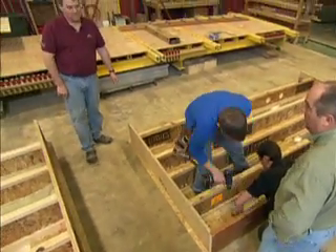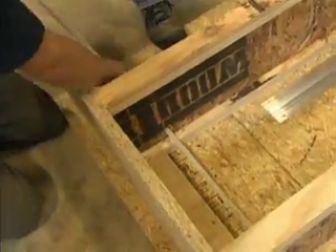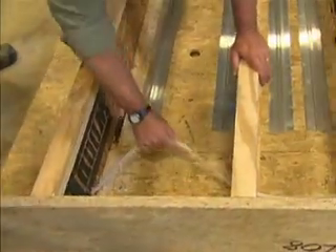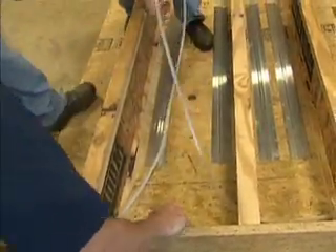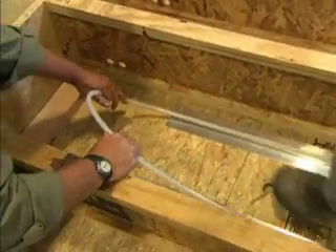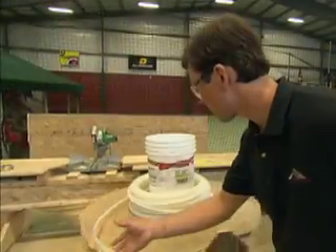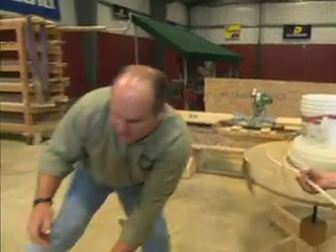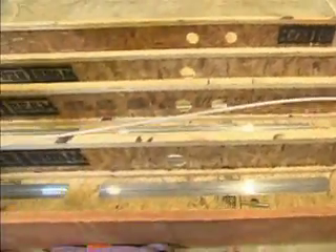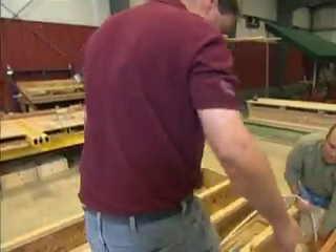All the tracks for this room are done in about five minutes — now we just got to run the tubing. We pre-drilled all those holes, so this should come right together. I can just walk the tubing right into the channel with my feet. It certainly beats being upside down in a crawl space trying to beat that tubing into the channel. This is going pretty fast — how long do you think it would take to do all of the radiant in our house? With all the floors built in our shop, it would take about a day. If you did this on site, it could take like three days. That's pretty impressive.